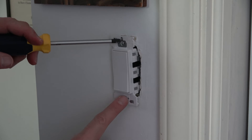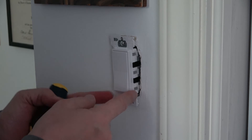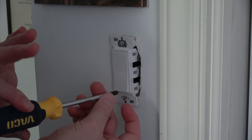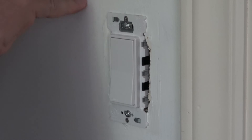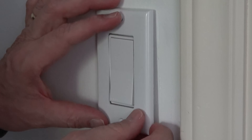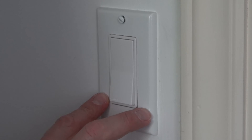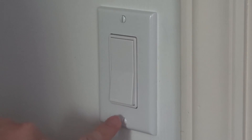Now all we have to do is push it back into the opening and secure it with the two fasteners top and bottom. A quick pro tip as you're driving in the fasteners: just make sure that you have clearance because this is a bit squarer than the old device that was in here, so you may have wall material that gets in the way. Usually a little push with the screwdriver gets that material out of the way. Also note you don't have to drive these all the way in — you just need to get it level and not tilt it to one side or the other. And if it's a little loose, that's okay; sometimes that comes in handy when you need to make just slight adjustments when you're getting on the wall plate. We're looking good, so all we have to do now is just attach the wall plate. Placing the screw heads vertically gives it a nice look.